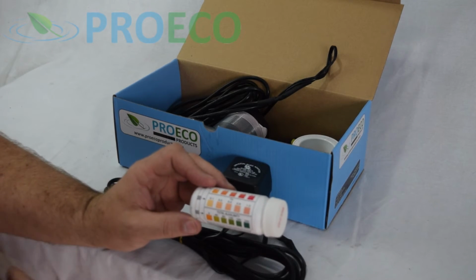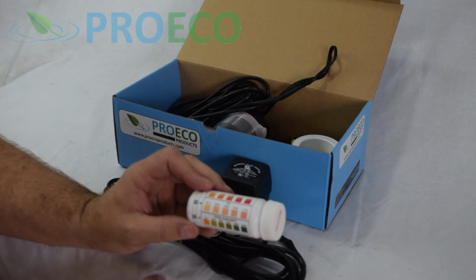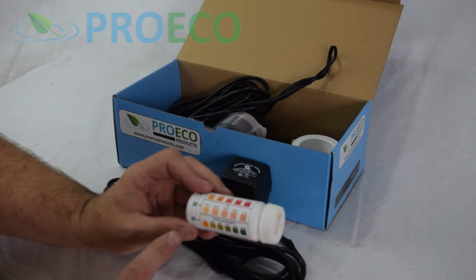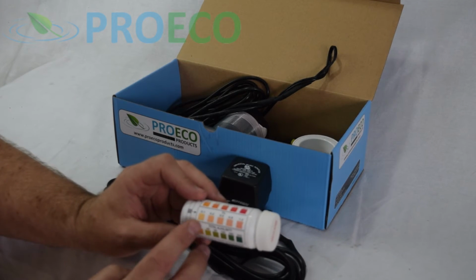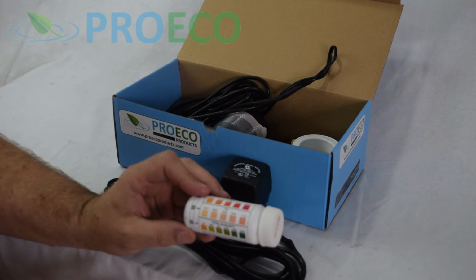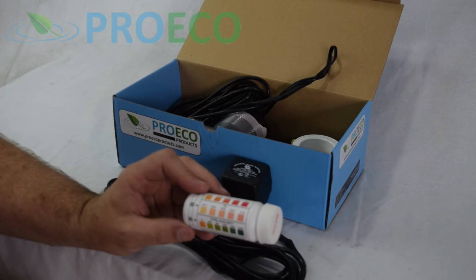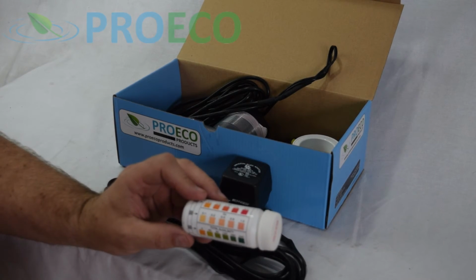Now, if you have a pond that had some stringy algae, you put in an ionizer, you begin to see it decrease, it begins to clean things up, and you're looking for the copper to come on the dipstick, but you just can't find any copper, like there's no skin color coming onto that test strip, that's because anytime a copper ion attaches itself to an algae cell, the algae cell ends up coating the copper and basically it becomes inert. So it won't be measured on here if it's done its job.